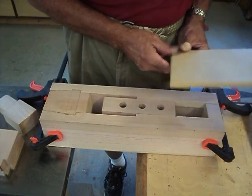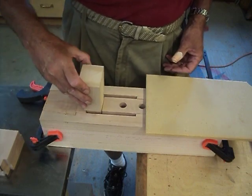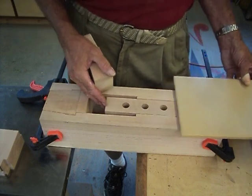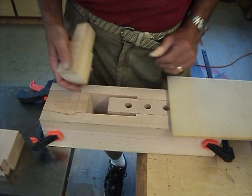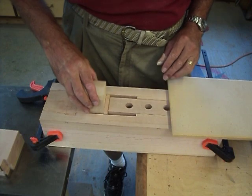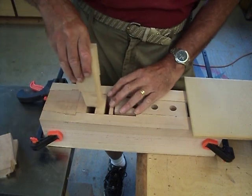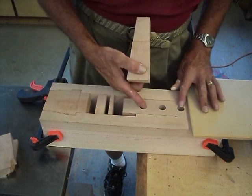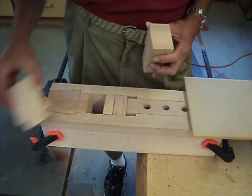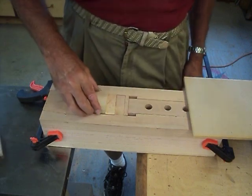So what you would do — you'd place your piece here, slide the appropriate hole up against it, and simply tighten it with your wedge. If it's farther out, you slide it up against one, maybe drop in a shim like that, and slide it up with your wedge. If it's a little farther out, you drop in another shim, slide up against it, drop in another shim — maybe two, maybe only two — and again, you tighten it up.